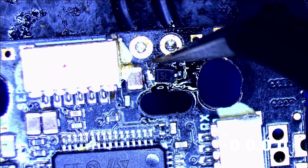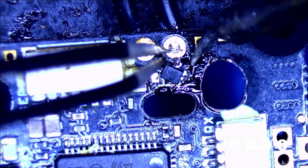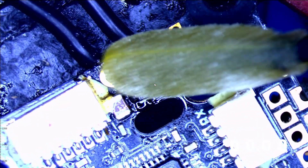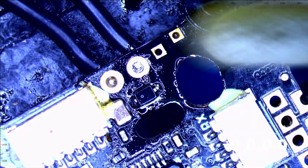Now that it's placed in position, we just need to heat it up and get the tweezers in there. Now we'll use our soldering iron and some fresh solder and hit the other side. Then I'll grab a little Q-tip — I use the microfiber ones, not actual cotton, just my preference — and let's get in here and clean this up so we can check our connections, make sure we're happy with everything, and power it up and test it.